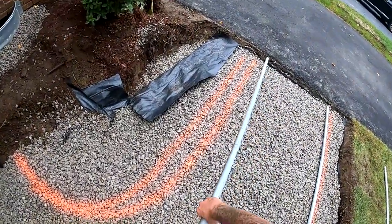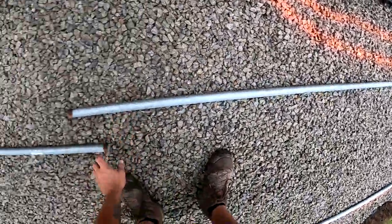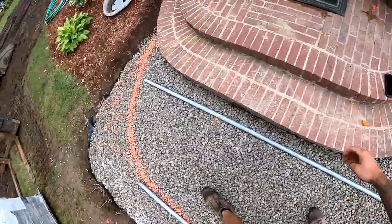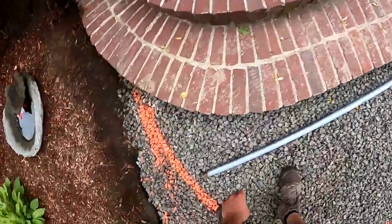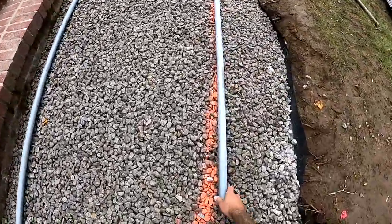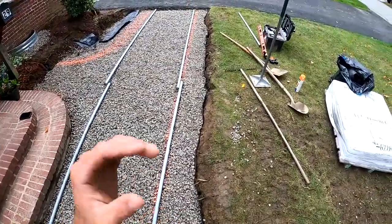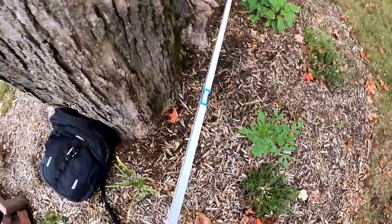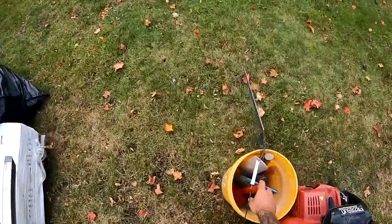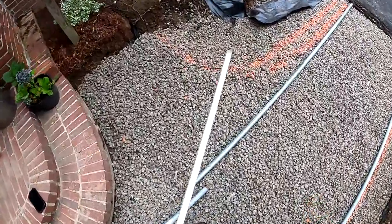You can get them from any of your home stores — Home Depot, Lowe's. They're inch interior gas pipe, so it's like an inch and a quarter exterior. Any kind of gas pipe smaller than that, they're just not really that strong or durable. After a while of using them and hammering them, they bend and they're just not a true straight edge anymore. So make sure you get a nice durable galvanized gas pipe for screeding your walkways or patios.